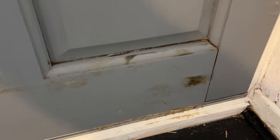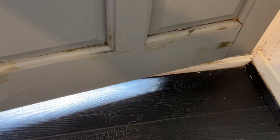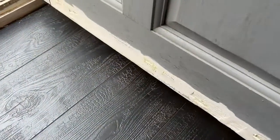Once I'm there and get a chance to take a closer look, I can see there's a lot of wood scrapings along the lower edge of the door as a result of the bottom rail having dropped a bit on one side. And when I try opening it, I can feel it binding quite badly against the aluminium storm guard threshold. It looks like the rail has swelled and dropped due to rain getting in.